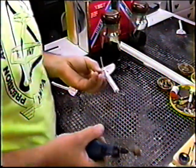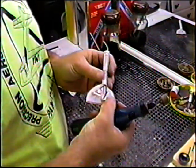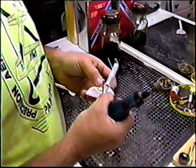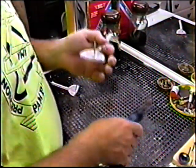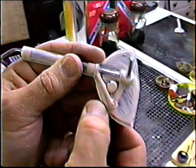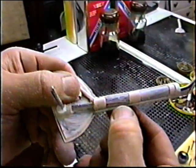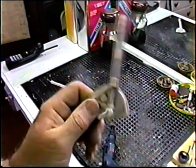I did a rough calculation of the weight. The original wood parts were 22 grams, so I'm going to try to at least tie with the wood, so that they aren't a lot heavier, or that they're close. By getting in and getting all these details relieved out, I'll put different tools on to get in there and get a nice relief on all of these edges. Make sure all the details are nice and sharp before I go ahead and put the Brodak primer on.